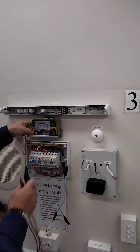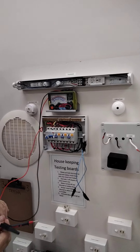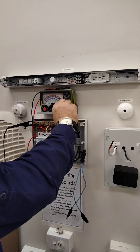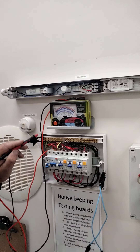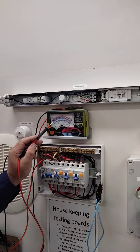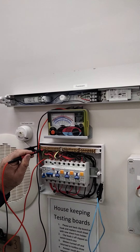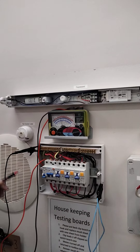I'm going to take this over to the testing board. First thing we're going to do is check the main earth. I'll put my clamp on my earth bar. Set it to three ohms and make sure when I've got the button pushed in it's reading ohms. Don't forget these meters read the opposite way - we read zero from the red scale one way, and when we've got 500 volts it reads from the other end up to infinity. At the moment it's reading three ohms, but if I push this onto the earth bar it's reading like a dead short.